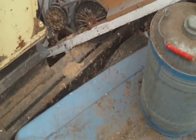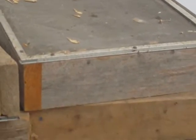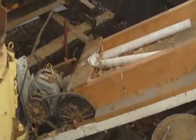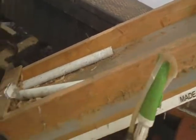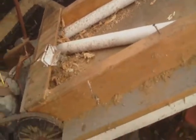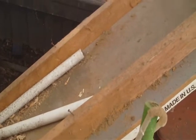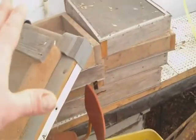Later I realized that waiting for the container to fill and then transferring them over takes a minute. So I came up with this idea — it's an old treadmill. I set it up so that the pellets would come out of the machine, fall onto here, and build up a little mound that would push a micro switch. It'd kick on and take them up to here, then shut off. That gave them a little bit of time to cool off before they fell into the drying racks. It would go up there and drop into the cooling rack.